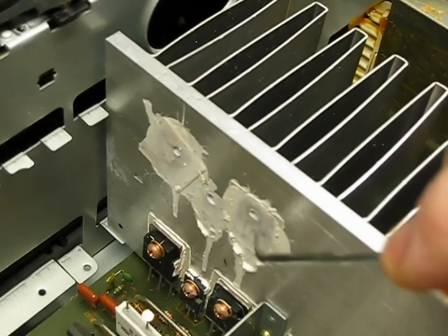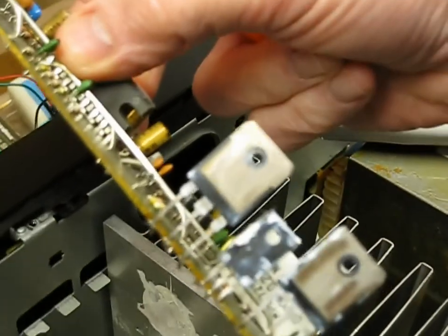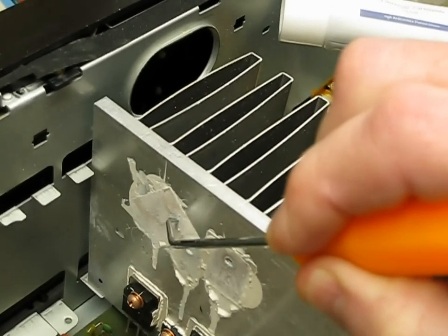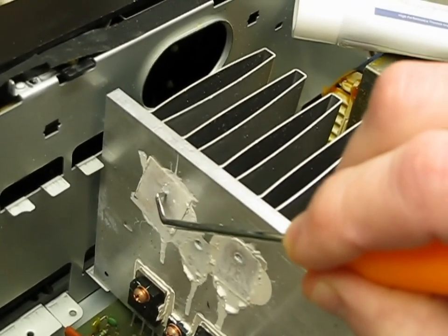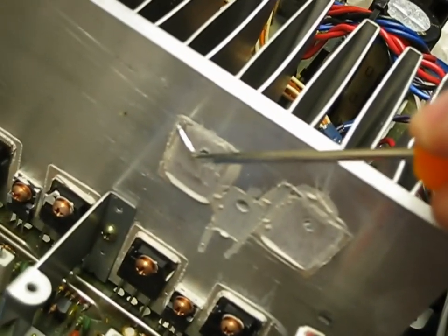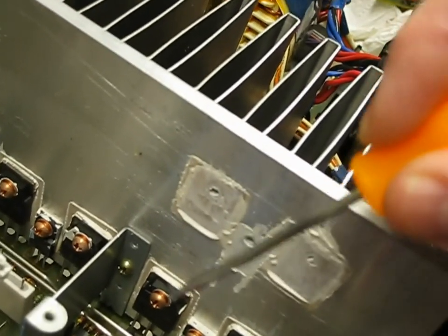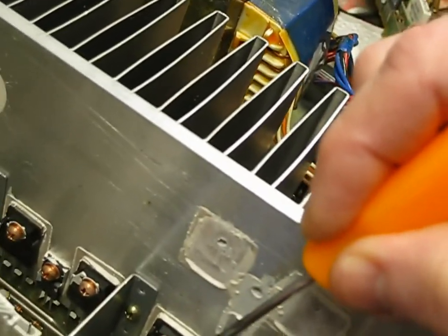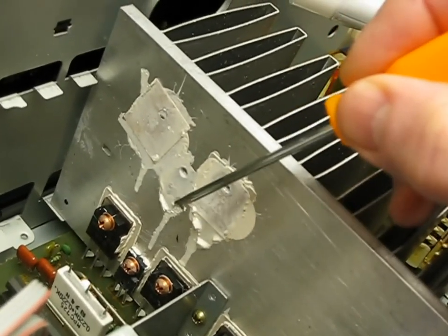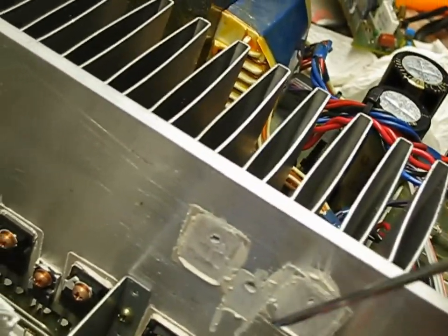Now putting the board back in — on the larger transistors there is an insulator sheet that must be in there. Notice on the back there they're metal, and that is part of the circuit of the transistor. If it hits the ground, it's kind of all over for you. Another thing that makes me believe this board was pulled out before is it seems like there's old original grease underneath the insulators. There's no insulator on the smaller transistor — that's plastic on the back, not metal. But notice there was a much runnier thermal grease used, not as thick as the paste from the original.